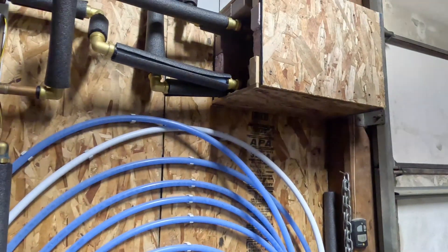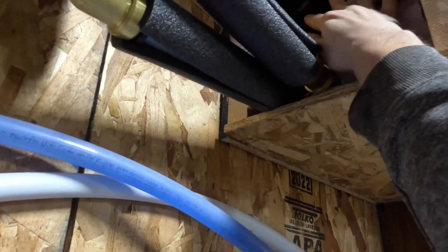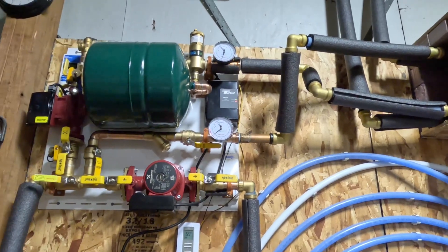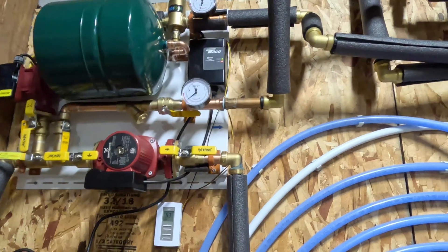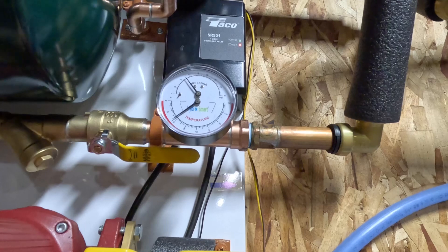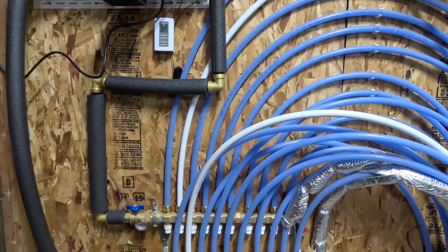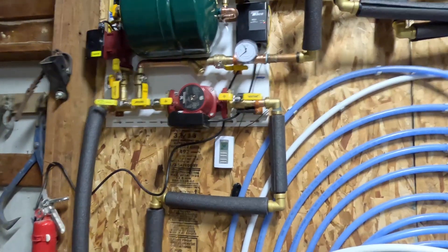This was all last minute in the late fall so I just got it in. I'll close this up eventually — you can feel the warmth. Pressure is good. I wanted to see what the pressure would be once it gets up to operating temp with this bigger pump. As long as we don't go above 30 PSI we'll be okay.